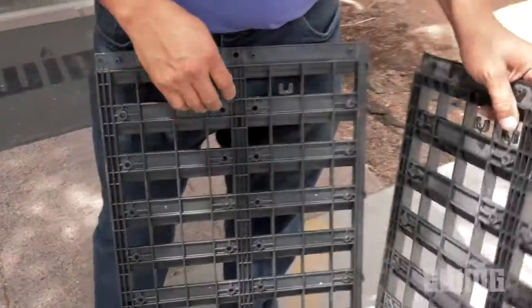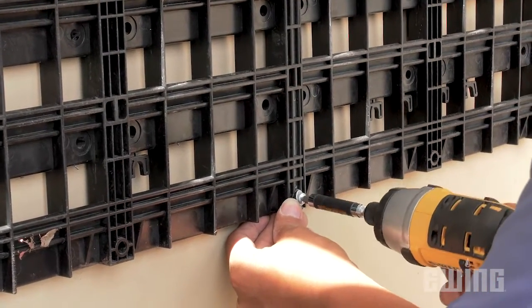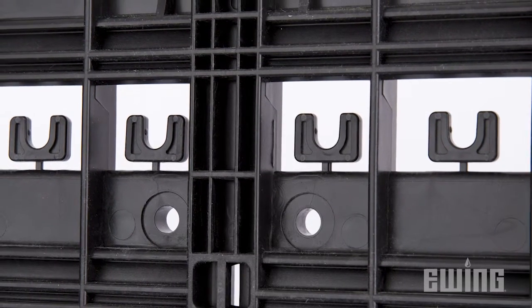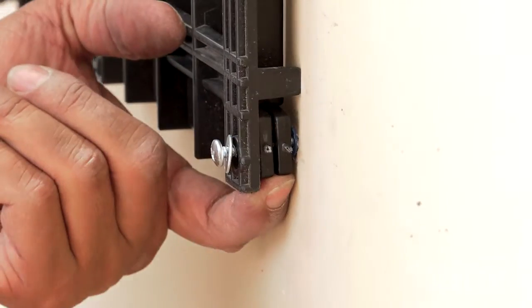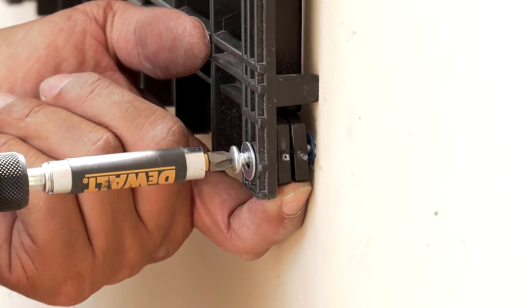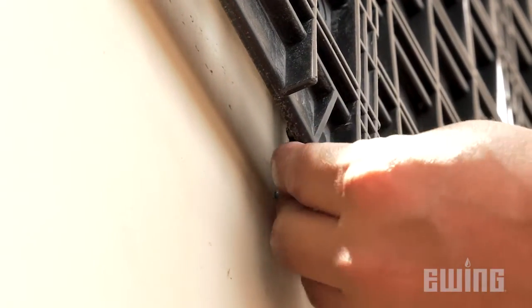With the trays completed, you can begin installing the mounting panels. Depending on the structure you're mounting to, the hardware may vary but should be 1/4 inch in size. To provide a firm mounting base for your hardware and to prevent the corners from bending, C-shaped spacers are included with each panel. Use them to fill the void between the panel's mounting points and the structure you're mounting to. A spacer should also be used in between the interlocking mounting points of each panel when connecting adjacent panels.